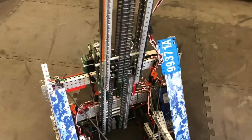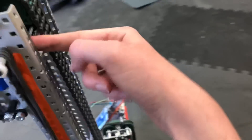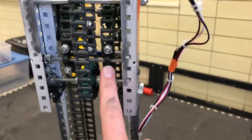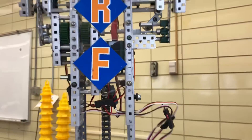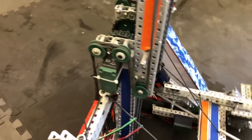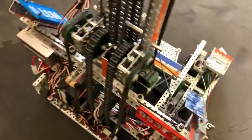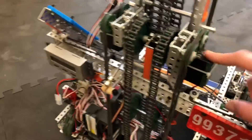This one in particular is five stages. This stage again has two links for strength, connected back here and also up here with perpendicular bearings. The final stage is just one link because it only has to lift the final stage, and it's connected in here. We have our four-bar going up and down. I'll do a quick zoom out so you can see the whole thing. A quick cascade could potentially be the way to go for the next competition, Turning Point, where you have to place caps on poles.